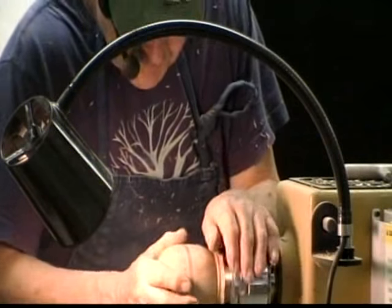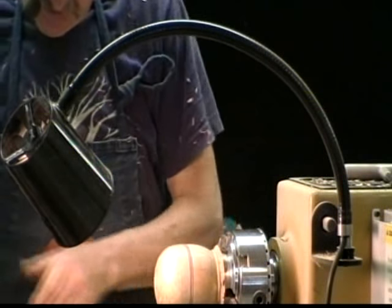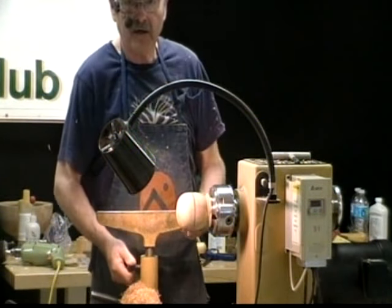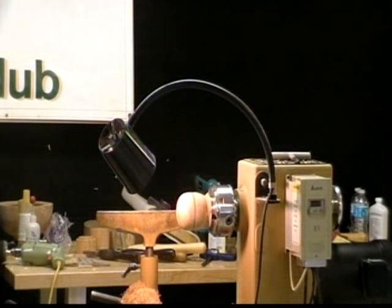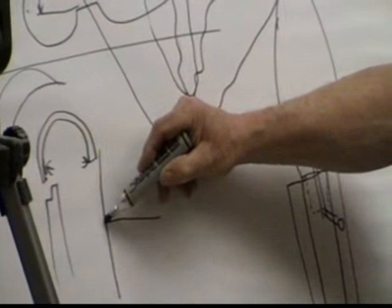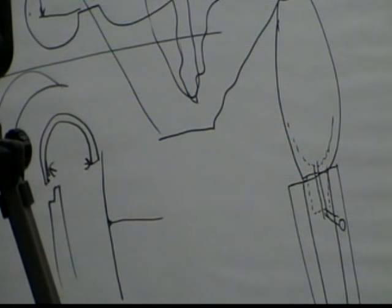There's just one, I'm just going to check for any torn grain. One little detail that's important when you're making a box, whether it's one of these boxes or just a straight grain box, you see where the lid meets the body right there, when that closes in, you've got a joint. Always round the two corners slightly here, so that if the wood moves a little bit, you'll never feel a sharp edge because it'll be rounded.